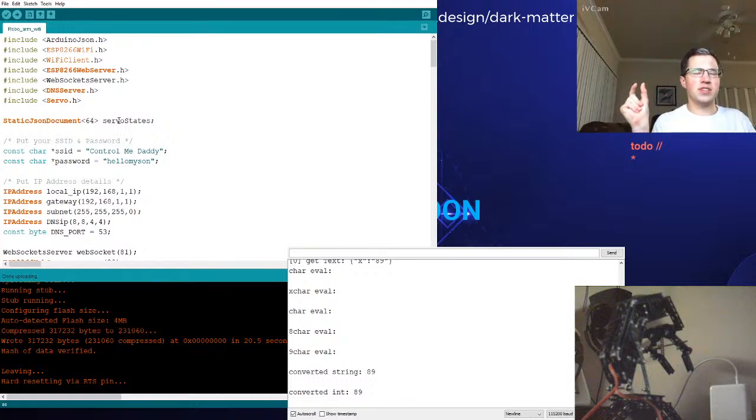Say we send an X coordinate of 75. We read that, then go and move the servo to 75. The whole time I could be getting more data coming in. I don't know if there's an interrupt or how this works. I guess we could test it and find out. That would probably be the best thing, so let's do that.